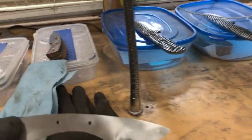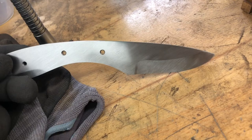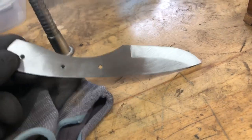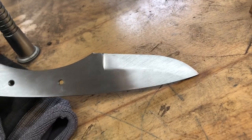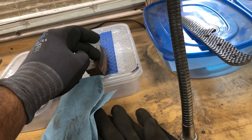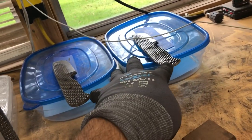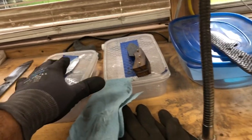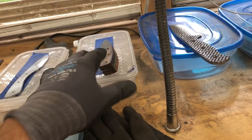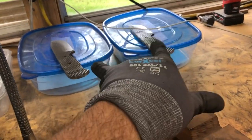Okay, I showed you my wood enough — let's get to work. I went ahead and got the bevels ground and got this sanded up to 220. I got all the bevel grind lines sanded out. Now I'm going to stop and epoxy the handles onto Donald's knife, then get these up to 220, go to 320. Let me get this epoxied on and move it over to the other table. I know I'm going to get these two up to 220 next.